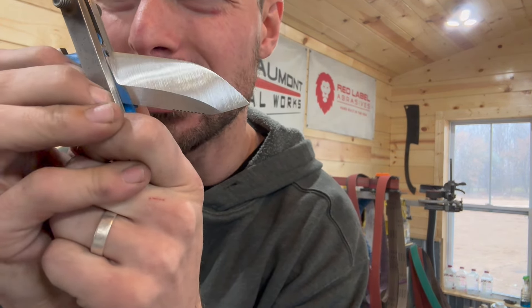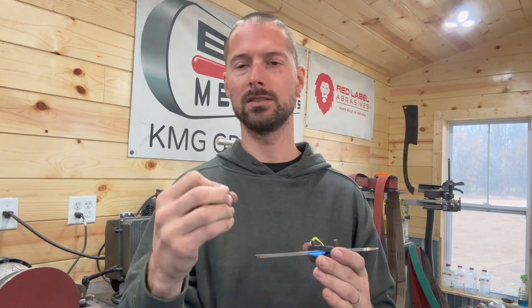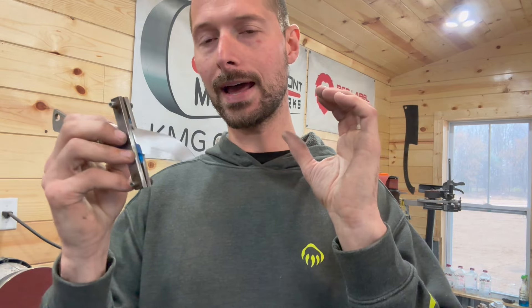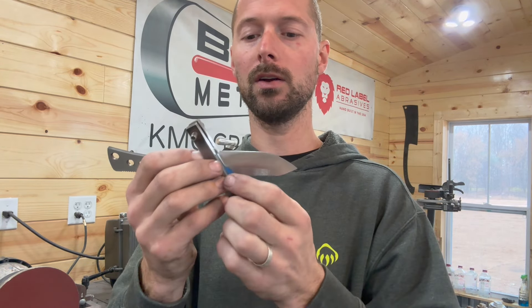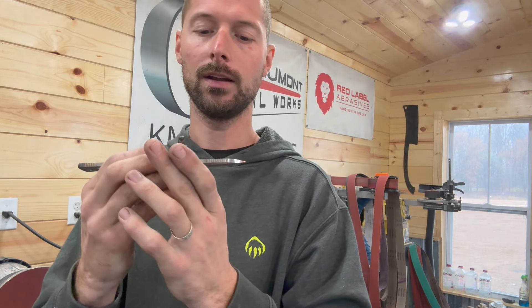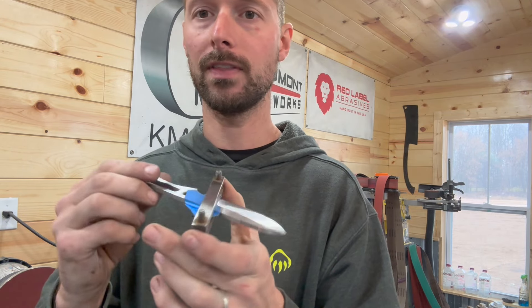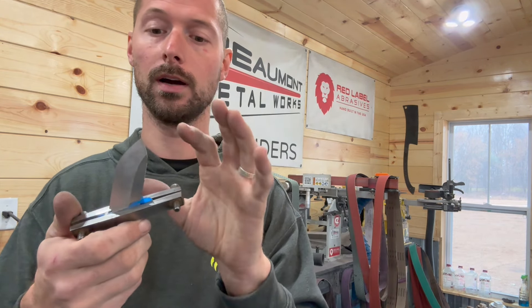That side's looking good. You can see how I eliminated that swoop by applying a little more pressure. This is so much feel, it's hard to make these videos and explain stuff because you really have to be hands-on doing it to understand what I'm doing. Hopefully you can take all of this and put it into the next time you try to grind bevels and it helps a little bit. The 120 is done. We've got the A100 on now. We're going to slow that belt speed way down to maybe 40% power, and now all we're doing is refining the scratch pattern, getting rid of those 120 grit grind lines, and just barely adjusting the bevel — getting that very top edge of that bevel with the A100 to crisp that up a little bit.